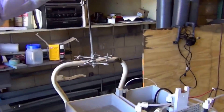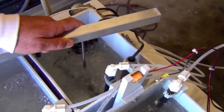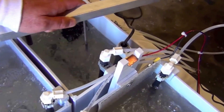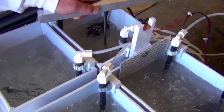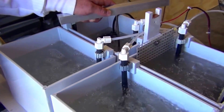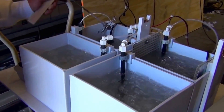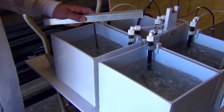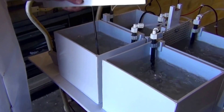You want to start off with your parts pre-racked and pre-cleaned. They have to be very clean. Then you want to go into the etch tank. You want to be in the etch tank for about 10 seconds. Let the parts drip over the etch tank to keep the etch solution in the etch tank, and then go into a rinse tank — clean water, preferably deionized distilled.